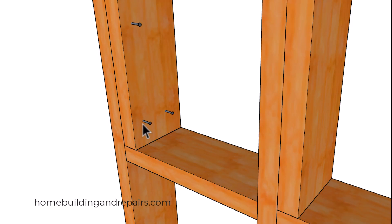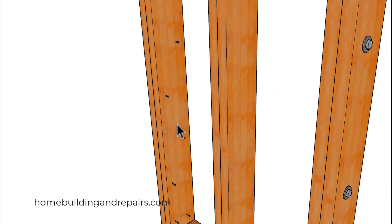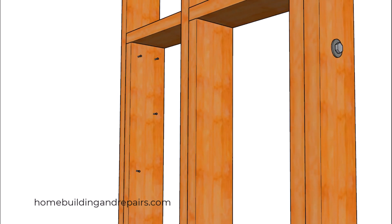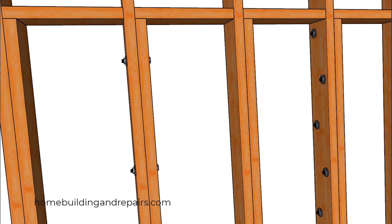You can use 16D nails or screws. When using screws, you might need to get some that are a little stronger than your average screw from your local hardware store. Wider lumber might benefit something like this — I don't think I would use 2x4 for a wall longer than 10 feet. You might consider using 2x6 or 2x8 for longer walls. We can either nail it, screw it, or bolt it together, and bolting is going to be the strongest method.